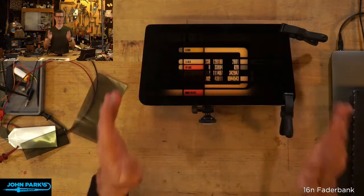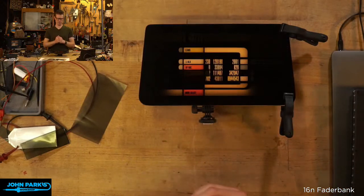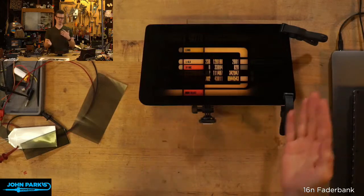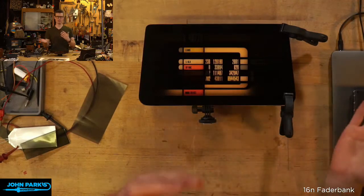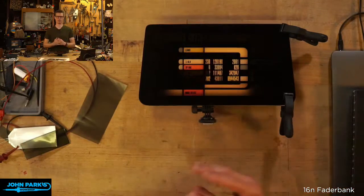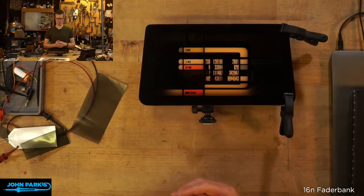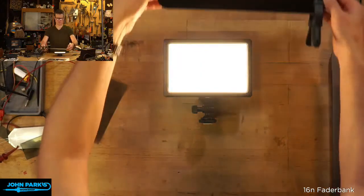I'm going to be using an external power supply for it. I think a 10 amp 5 volt, and see how that works out. And that'll be with the Matrix portal. You can also do this with Raspberry Pi, and we have a driver board for that, which I'm hoping not to use, but maybe gives you some different options for things like playing a video instead of a sprite sheet. So all stuff to come on the LCARS project.